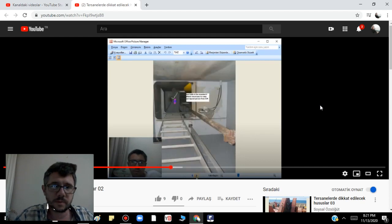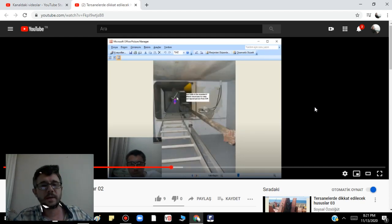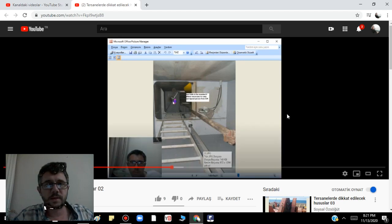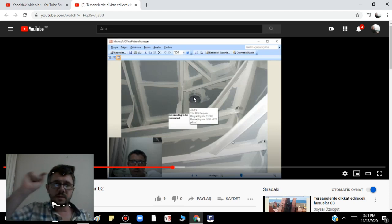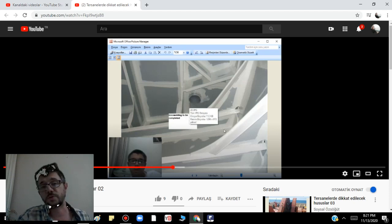Also one letter missing here — so when you look and you see any problem in the shipyard, especially for new delivery, you just tell them to make it. I was talking about the air vents — this is an air vent but from inside one of the tanks. Sometimes they forgot to remove the top cover. There is a small cover from the factory — it is just spot welding, you can remove it. Sometimes it is forgotten in new delivery vessels. Don't forget to check, otherwise when you overflow, water will not come out.